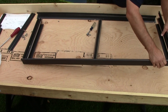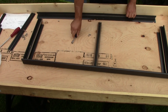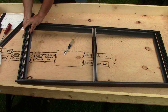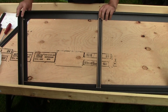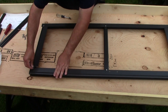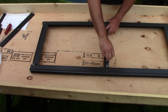Now we need to make sure that all the glazing bars are perfectly inserted as deep as you can. Then you can insert the gutter. If you want to make it easier, you can reverse the assembly on the other side. It's important to make sure that all the parts are perfectly aligned and inserted as deep as you can.